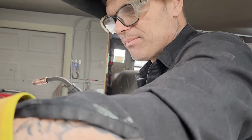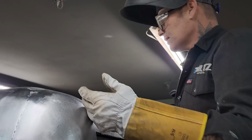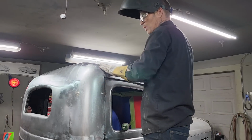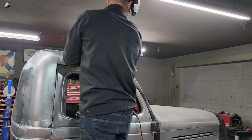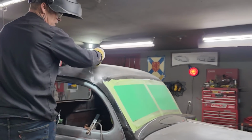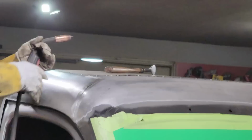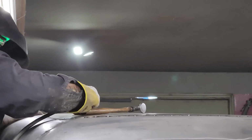It's just a little hint that I ask for sometimes if we're building something, if Aiden's welding something up. Just have the thought in your brain, when it comes time to grind it off, what are you gonna be able to make it look like? And if I put a little extra weld on this side of the sheet metal, then when I get to grind it off, I get to feather it off a little bit. If I weld it hard up and leave a big edge there, a ledge there, then it's hard to feather the weld off to make it look good. Hope that makes sense.